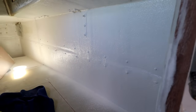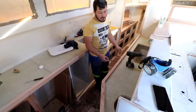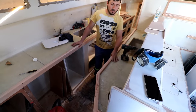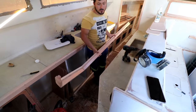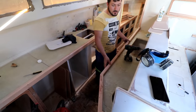Leave a comment below if you think we should close up our bolts with a trim or just leave them open and painted. As you saw in the other episode, we epoxied those front room trims, but I don't want to epoxy these ones because these are working surfaces. Here you're always going to be cutting and if you want to change the countertops, you want the trimming to come off so you can replace the top, trim it nicely again right up to the edge, and put the trim back on.